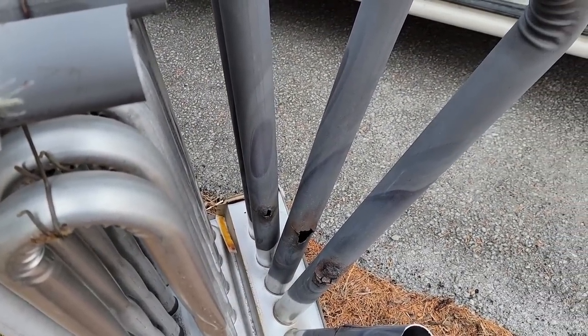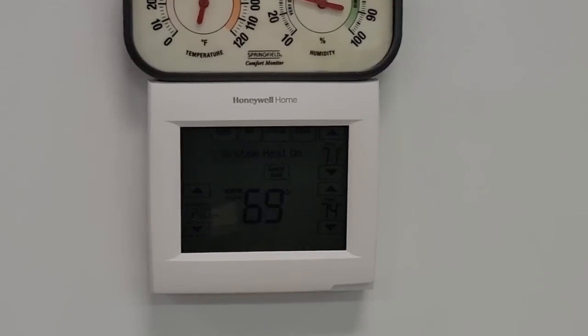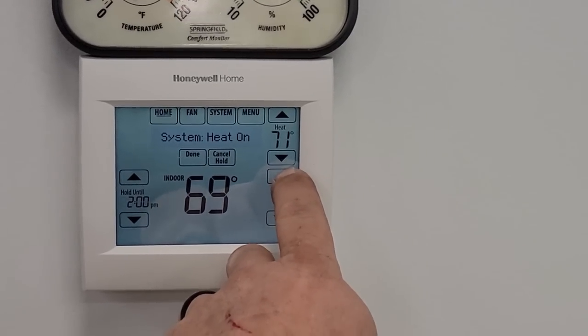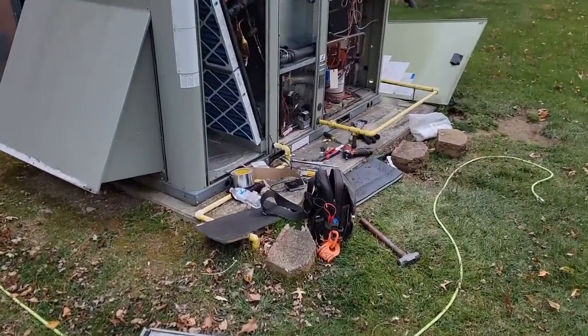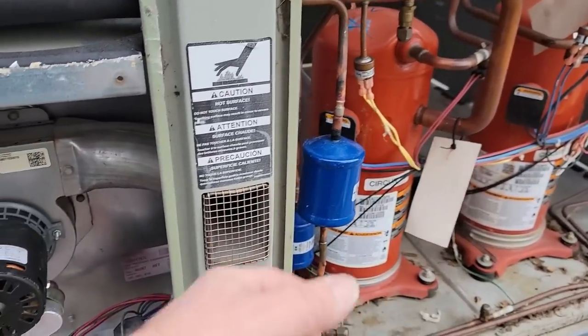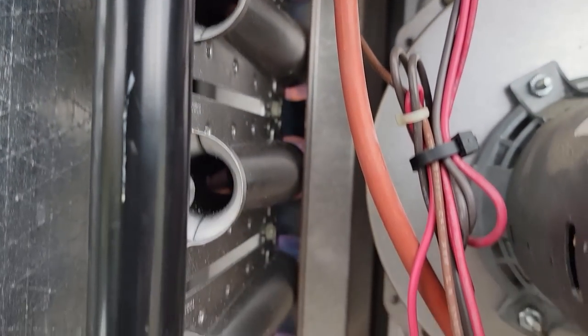They ain't been checking it and completely ignored it. You can see the thing — the turbulators that were broke — that's something you've got to make sure you're checking, otherwise you're going to have things like this happen and it makes you look bad. You can smell the oil and stuff but it's not too bad. I'll go ahead and turn it back down just a touch — it's a pretty good size building so it didn't create too much of an issue. Everything seems to be burning okay. What's surprising is this one really hasn't had that many problems otherwise — the refrigerant was fine, the little baffle thing was screwed up in there but she seems like she's running and roaring.